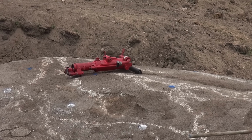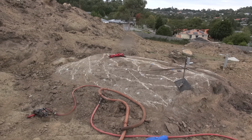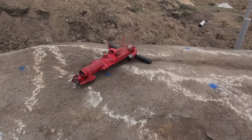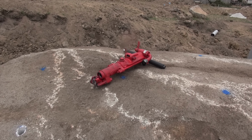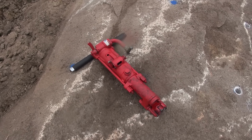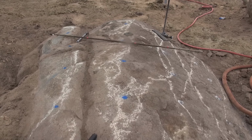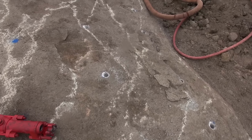It's been a good day though with this new drill, the CP69. Yeah, it's a rocket, it really is. It looks very similar in operating characteristics to my all-time favourite, the Silver Bullet, that broke on this job recently. The handle came off it. It's quite smooth to operate. It's very powerful. Quite heavy though, and a bit long. It's a bit too long really for a short ass like me, but I can make do. It's a bit difficult doing 600 mil steel changes, but if I went to 400s, it'd be really easy. But it smashes down the holes really quickly, which is great.